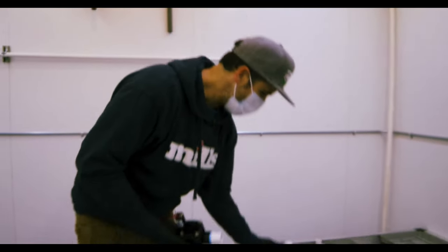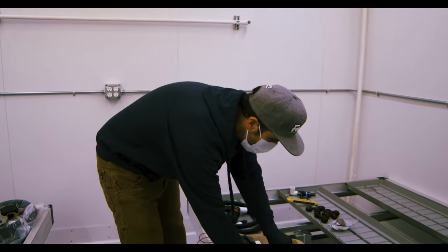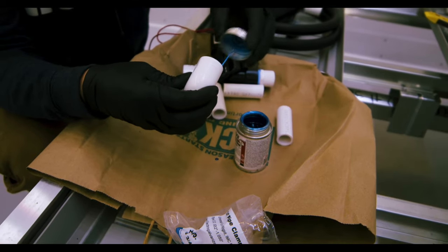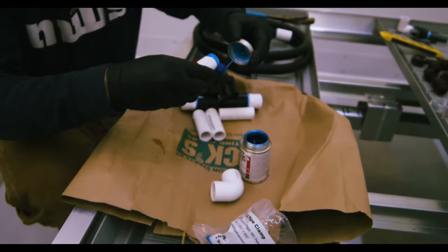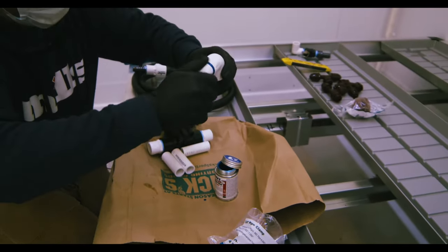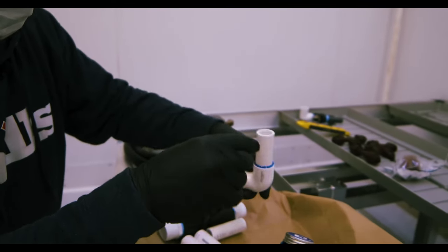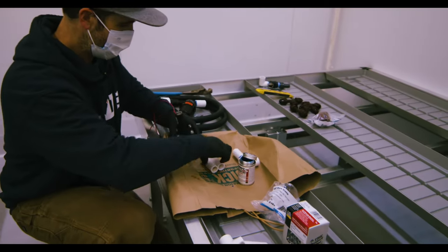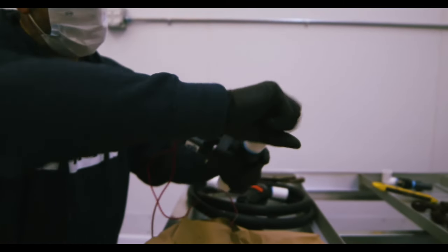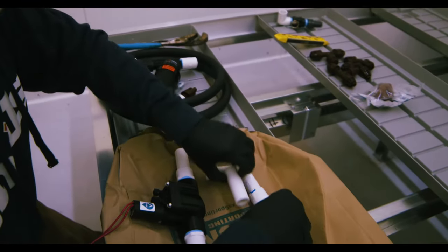I supply all your fittings for you. The first piece is the elbow, so I'm going to go ahead and glue all these together. You'll see how I get really nice clean glue joints on all my fittings. Put some glue in there, a little glue right here, very carefully put this in, spin this, and carefully let that dry. I'm just looking for that gloss to come off so that'll dry. Our next glue joint is going to be this. I like twisting this so you don't see the writing on the pipe — no dripping or anything.